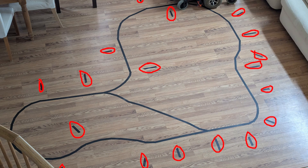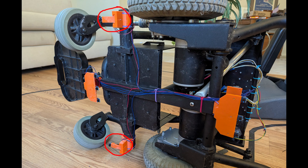We can do better than using the naive approach of this algorithm. Controls is all about having an internal model of your system and only using sensor feedback for minor corrections. So, in order to implement an internal model of the ride profile, we can put little track tick marks all the way along the profile. Two more side sensors on the vehicle will be able to tell when it's past one of these tick marks and be able to know how far along the track it is. Because the vehicle knows where it is along the ride profile, it knows how much it should be turning at that point, and it only needs to use the line sensors for minor feedback and correction.